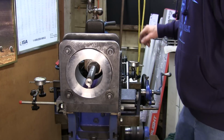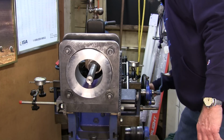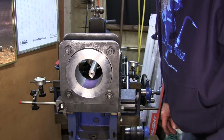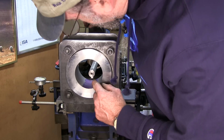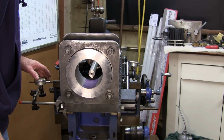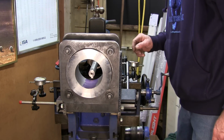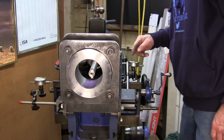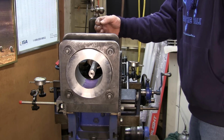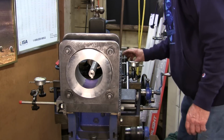Okay, we're just barely... Okay, we're creating a scratch right there on the starboard side. All right, now we're gonna set our indicator at zero on this side here, because if we were feeding that way, it would be coming up to zero. And we're going to run it and cross over in that direction towards the starboard side until we get a scribe on this side here.